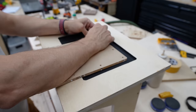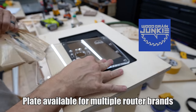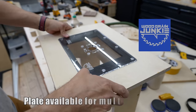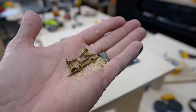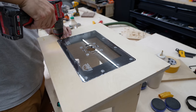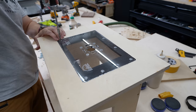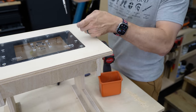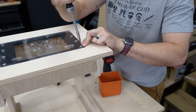Now it's time to mount the plate in the router table. I bought this off of Etsy from Woodgrain Junkie — I purchased this myself, he has no idea I'm making a video about this, but I thought this was the best solution for my setup. I'll link to these in the description. I'm gonna pre-drill the holes and use some really tiny screws just to kind of hold this in place — I think gravity with the weight of your router is gonna hold it more than anything. I'm using a little Wera ratchet screwdriver to tighten these screws in because you don't wanna over-tighten with a drill or driver — you will strip this out real easy.